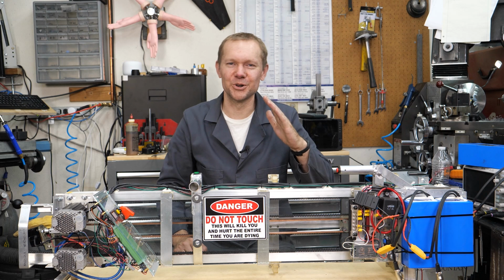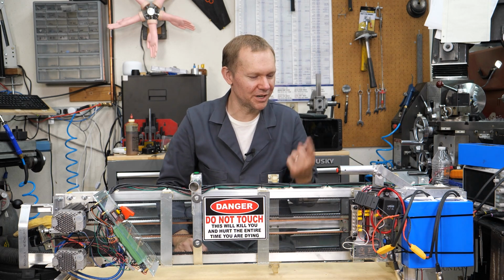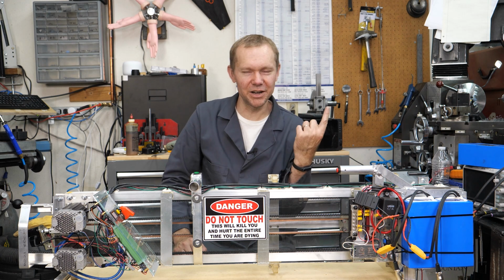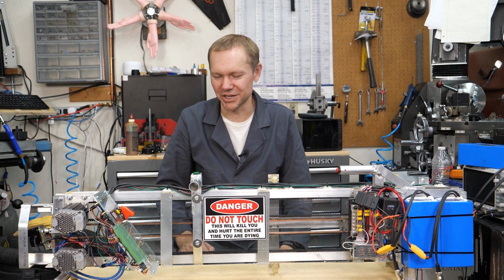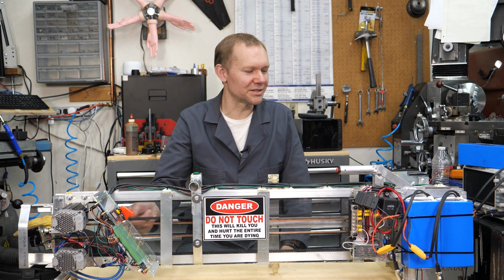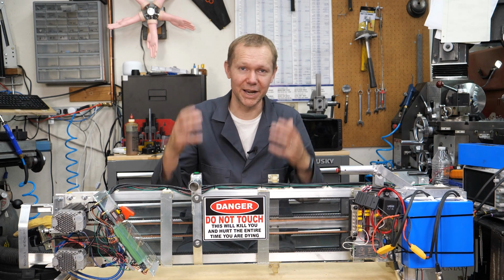So that way, if we wanted to adjust it slightly, which I think we're still going to come back and maybe tune it a little bit, when you made an adjustment, it would hold. You could see that so consistently. Probably because taking backlash out of it, it's running it all the same direction,